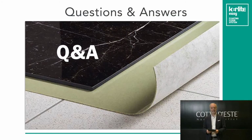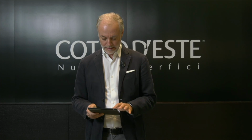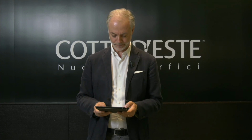Can I use Kerlite outdoor? No, unfortunately, Kerlite Easy, sorry. The question was whether you can use Kerlite Easy outdoor, and unfortunately not. Kerlite Easy can be used only indoor. Can I use Kerlite Easy over heated floors? Yes, that's a very good question, and that's absolutely guaranteed. Kerlite Easy you can install over heated floors. In fact, the silent mat and Kerlite itself are excellent heat and temperature transmitters.